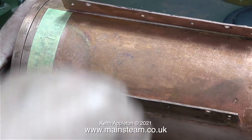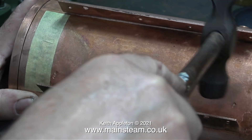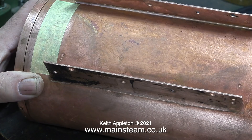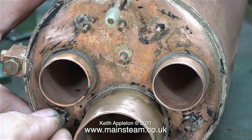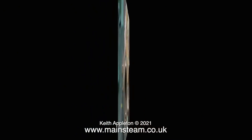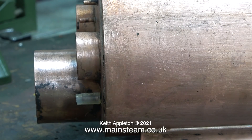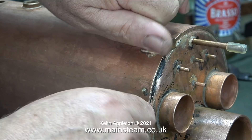The brackets need to be straightened, so I'm doing this very gently with a small hammer. If you haven't done this before, be very careful because copper is a soft metal - if you apply too much force you will do severe damage. With a bit of gentle persuasion, the main mountings are now quite straight. As I intend to paint the boiler using spray paint starting with etching primer, I'm sliding some silicone rubber tubing over the threads on the chimney support parts.